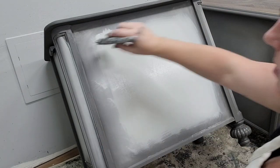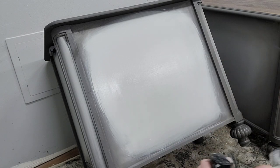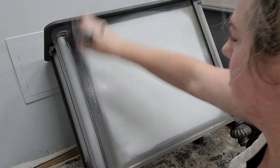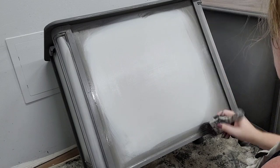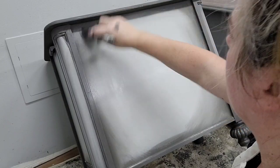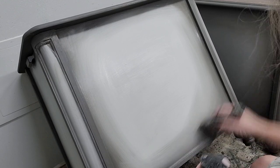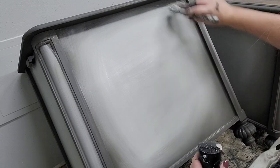I'm doing two coats exactly the same, and this is my second coat. The first thing I do is apply Dixie Belle Driftwood to the body, keeping it wet using my mister bottle. Then I apply Gravel Road around the outside of the Driftwood and start brushing them together around the edges. I want these colors to fade into each other so you can't see the definition between them. I use my brush with barely any paint on it as a dry brush and work them together lightly, working my way around the four corners, doing small areas at a time.